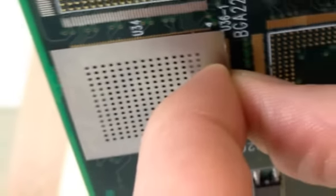In addition, there are some tricks or gotchas in this particular process. There's sometimes a lack of coplanarity between the stencil and the board, and that can cause solder paste smearing. Also, the stencil can move around during the printing process. Many times we have bypass caps and other resistors around the BGAs, and that makes it difficult to fit these devices in. Lastly, when we remove the device, unless we perfectly lift it up, which is impossible to do with these metal stencils, perfectly perpendicular to the board without smearing, we're going to have to carefully lift it up and hope that we haven't smeared the paste print pattern. Otherwise, we have to start over.